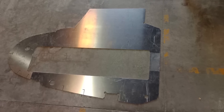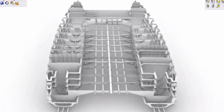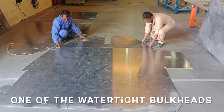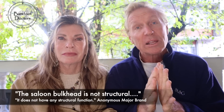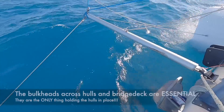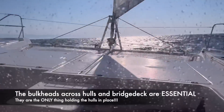Let's talk about bulkheads because there's such controversy and they're kind of a hot topic. There's a lot of lack of clarity over what bulkheads represent on a boat, and even some of the comments coming out of the major brands are absolutely ludicrous. For example, one manufacturer told an owner that one of the bulkheads on their boat was not structural - this is absolute garbage. Every single bulkhead on your boat is structural because it is an integral part of the strength and structure of your catamaran. Bulkheads are so important in catamarans because they are basically the only things holding the two hulls together.